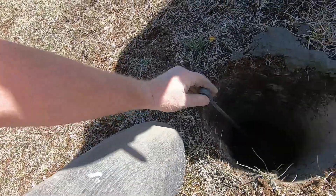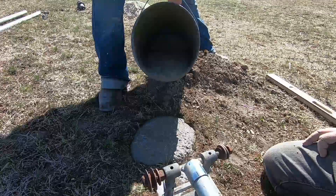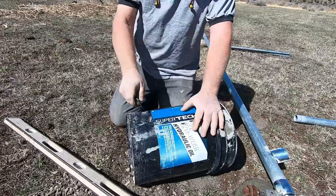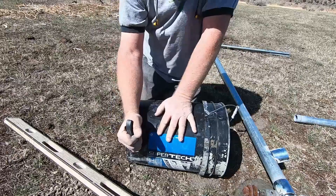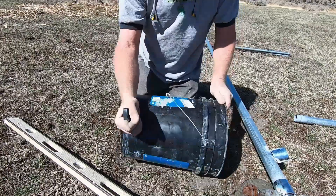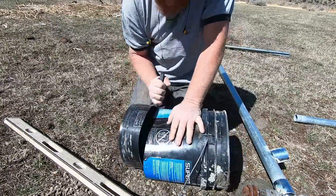That's a good mix there. We'll put the rest of what you've got in that hole. So here's our solution — we are going to cut the bottom out of this and make our own sonotube out of a bucket. I probably shouldn't have cut this good bucket.